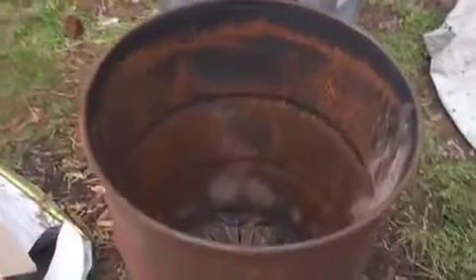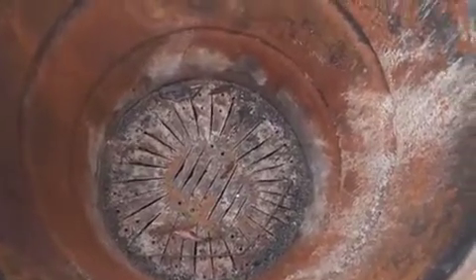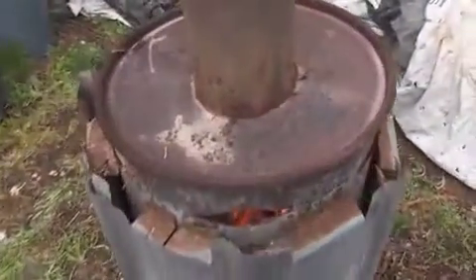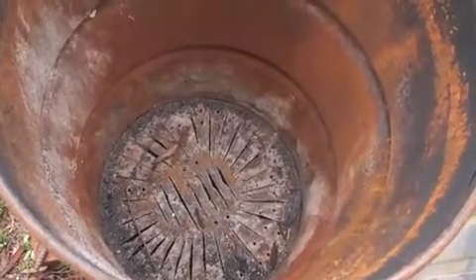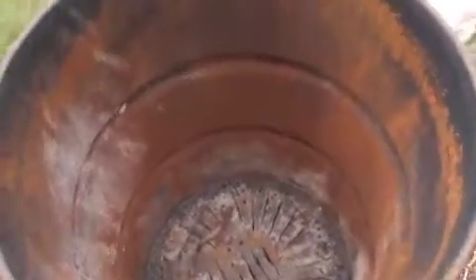In here it's snap, crackle, and pop. In the meantime, I wanted to show you this is a regular T-LUD — slots in the bottom, bent to open them up a little more to help more air come in. No holes in the side, just the same lid. I have five feet of eight-inch pipe screwed onto the lid with bailing wire. Air sucks in through the seam and helps the burn be totally complete by the time it comes out the top. This T-LUD system is another way of making biochar, but I find that people like to use blowers on it to make sure enough air is getting in for a clean burn, otherwise it can get real smoky.